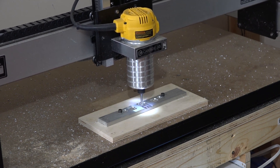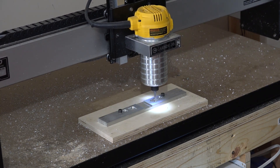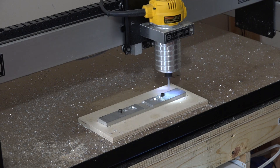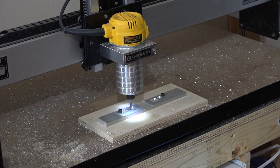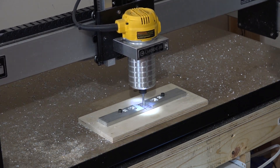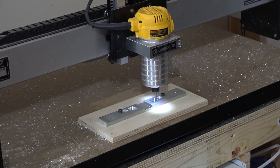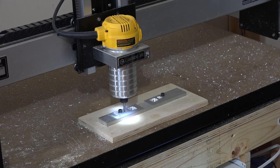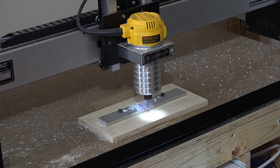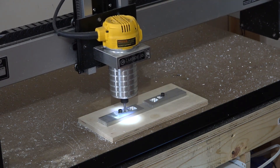If you look at production metal cutting machines, they're generally run with coolant. Using the proper settings, much of the heat generated will be carried away with the chips that fly out of the part. The main purpose that the coolant serves is to clear the chips away from the cut. When chips clog the path of an end mill, they can be re-cut, which is really bad for tool life — it can even cause tool breakage. I tried WD-40 as a lubricant, which is somewhat commonly used for aluminum. It soaked into my MDF wasteboard so double-sided tape won't stick to it, and it made the chips heavier so they just collect instead of being carried away. Since I've stopped using WD-40 and cutting dry, I actually get better chip removal because the air coming from the router blows most of the chips out of the way before the end mill can re-cut them.